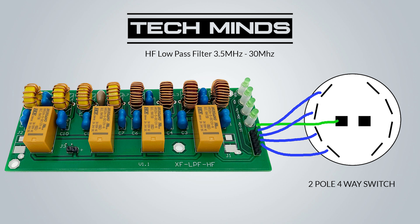In this slide we can see a diagram of a two-pole four-way switch. We have the ground connection going to one of the middle pins and then each band is connected to the outer pins. The right side center pin and outer pins are not connected at all to the left side pins.